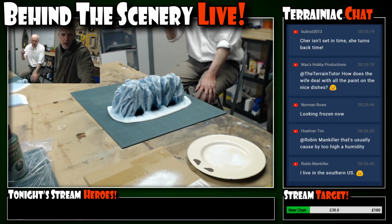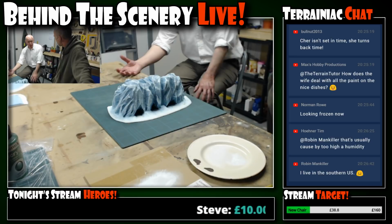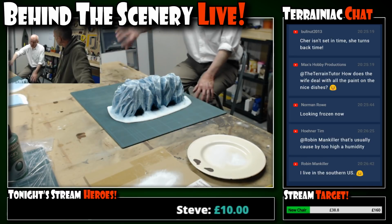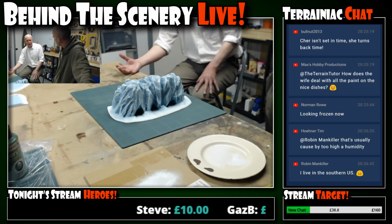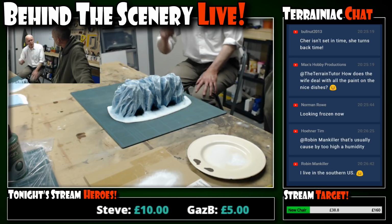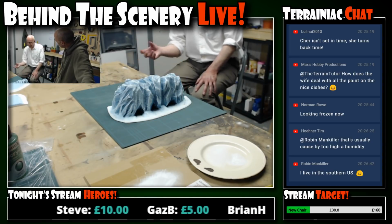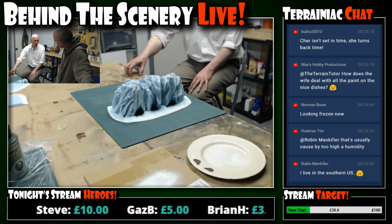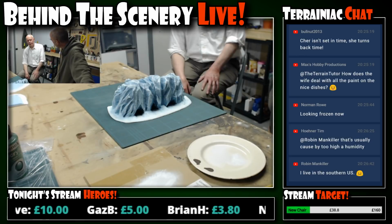Another little tip: if you're putting varnish on with a brush and you've got it in a container, then warm the container first. Put it on a radiator or something for 5 minutes, so the container warms up. So when you put the varnish in the container and dip in, the container is still warm, because that will keep your varnish liquid for longer, and it will also prevent that same problem with the moisture. It dries out the container and warms it up, because moisture can condense on a cold container, like a jar. And then you can get moisture in your varnish that way.